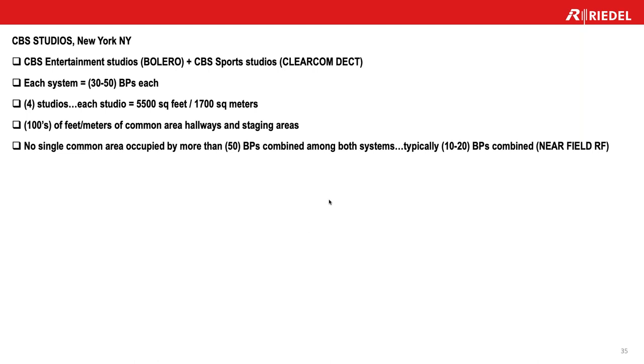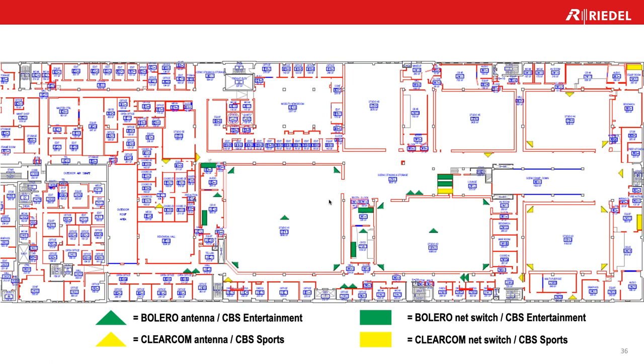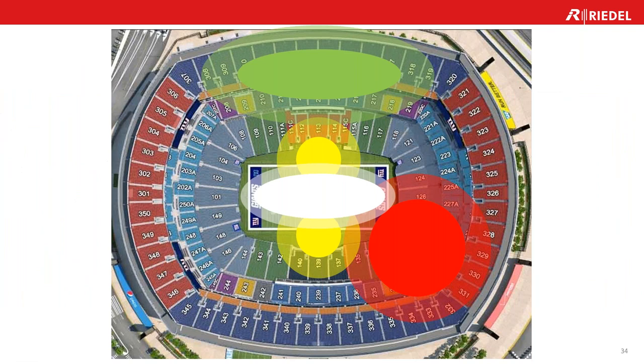Again, that goes back to paying tribute to the design of the codec being used and also the RF filtering hardware. It's a great system. It throws away the junk and keeps the rest. It's like if you need glasses and you don't wear them, and you're trying to see something 100 yards away, you can kind of see it, but not really. You put your glasses on and you can see it perfectly. That's why you can put one antenna in a stadium and go at it. But that falls under the category of just because you can doesn't mean you should. Obviously, you want redundancy, multiple antennas, playing to the design, which is diversity.